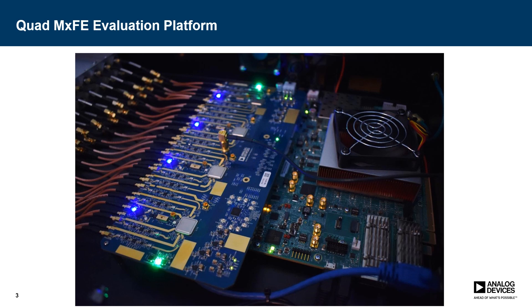My group at Analog Devices has taken the AD9081 and developed a board called the Quad MXFE, as you can see in the left center here. It is in blue and it is attached to the VCU-118, which is a Xilinx Virtex UltraScale Plus evaluation board. Our board also has cabling in this current photo, which sends out all of the transmit and receive channels to a series of combiners and splitters. There are additional clock inputs for our reference clock, and both boards are powered from 12-volt sources.